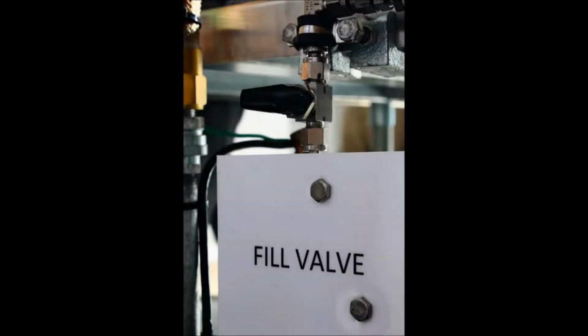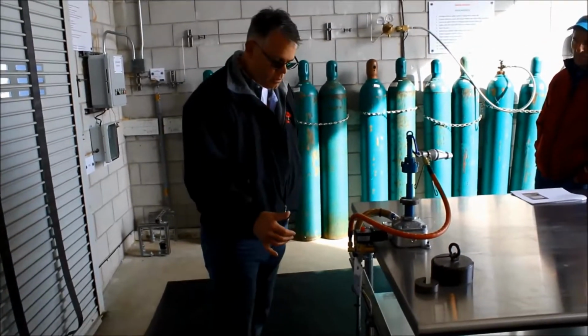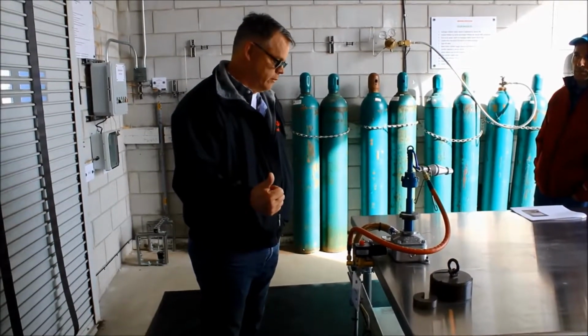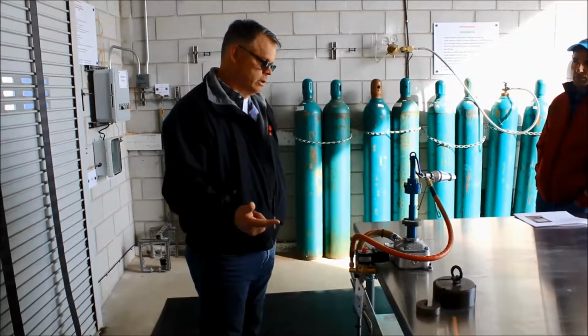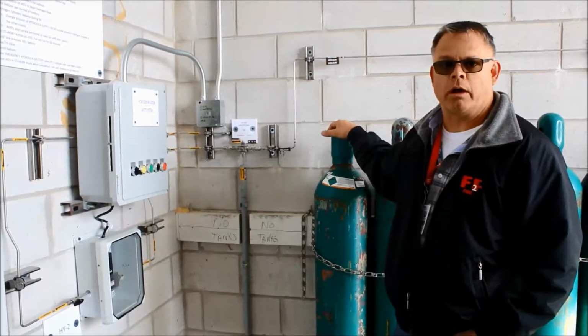Another important improvement for converting to hydrogen is that every place there's hydrogen, it's in stainless steel tubing, which is pretty small diameter tubing, which is a safety feature in that first it's robust, it doesn't fail in the event of a fire. Second, it has a small internal diameter, so it kind of limits the flow rate in case of a bad leak.